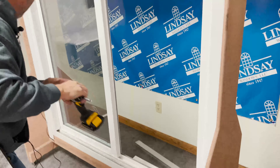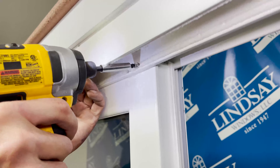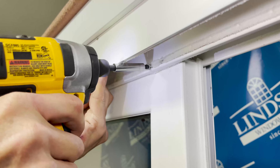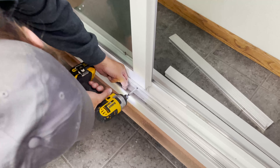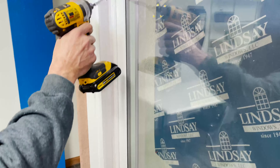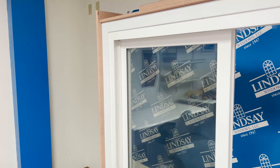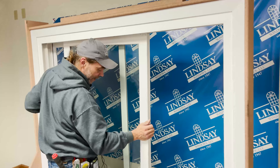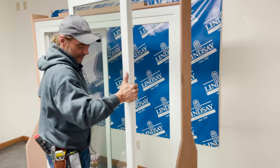Now we need a screw gun. I'll have to pull this piece too. There'll be some screws above the interlock and below the interlock. And there's normally a couple up this side, which there isn't in this door because it's a short door, but on your standard door there'll be a couple screws up that side too. Now this panel should be free and should slide right out — just pick it up and take it out. We'll set that over here for just a second.